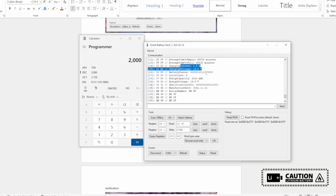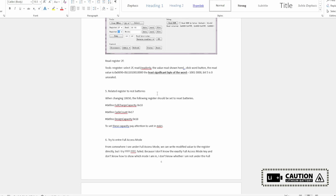Reverting back to 2000 milliampere — the hex value is 0x07D0. Write 0x07D0, also on the 10th register, click Word. Reading the data values again: full charge capacity is 2000 and design capacity is 2000. The charging current and charging voltage are back. If you want to change manufacturer data, you need to enter it in a specific order — you cannot simply enter data directly; you must convert it to hex values. The temperature is showing 27 — there is no thermistor on this board, it is preset.